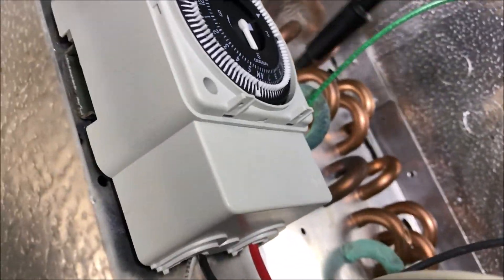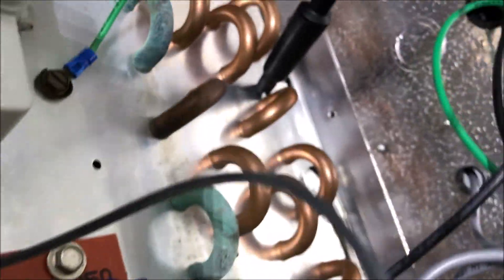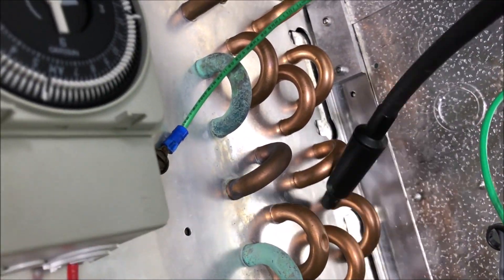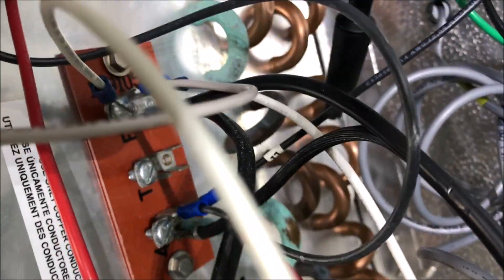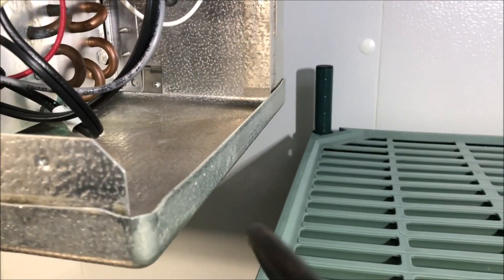You can see it's about 11:30 to 12 o'clock. I'm going to do a quick sniff of the other side of the coil before we get this repair done — let's make sure there are no other leaks in this coil. Let's hit all these U-bends; they love to leak. Look for any oil spots — I don't really see anything. But let's do our due diligence, take our time, make sure there's not a secondary leak. We don't want to go through all this work and then have it end up needing a coil. I'm confident there's only one leak and it's on the TXV.